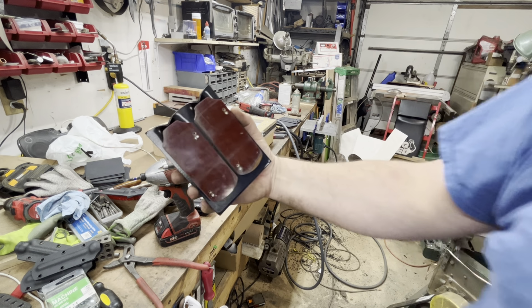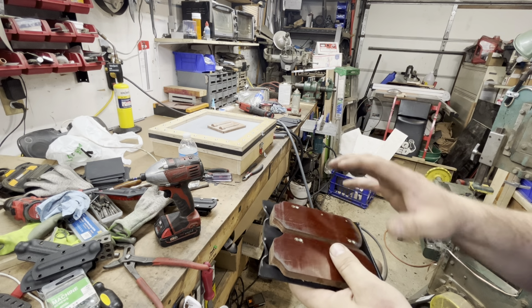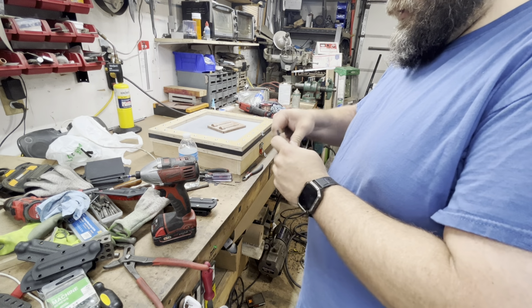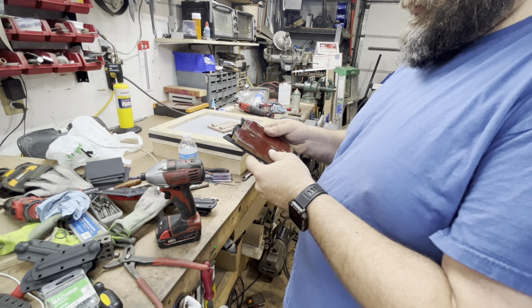So now I've got my split dies set in place. I'm just going to split this apart. Cut a little bit of the excess around the edges because that can grab on your router bit and pull things around, and it's not entirely safe. So what very little we can trim off will be better. Now it looks like I'm actually a little uneven, so I'm going to loosen these up one more time. Hate to do all this work and find that your die was off just a little bit. So we're going to make sure it looks a little better.